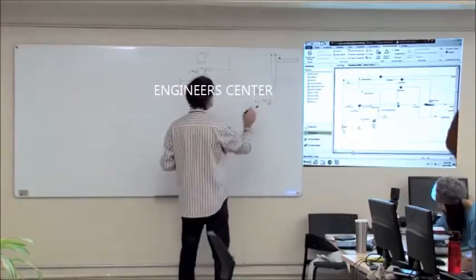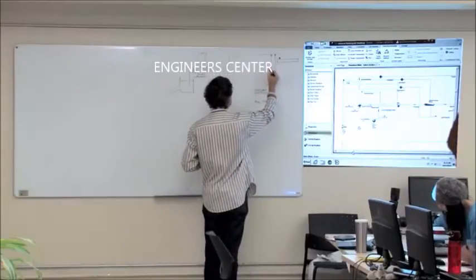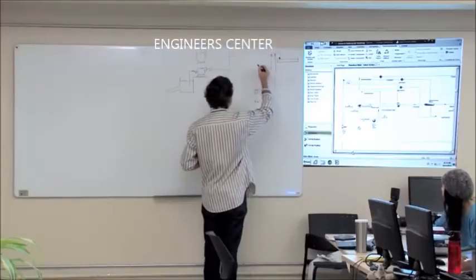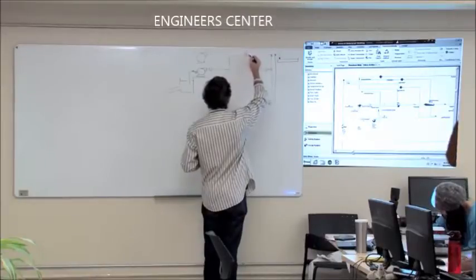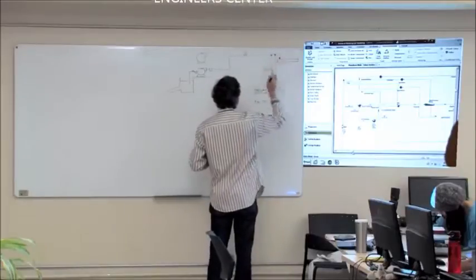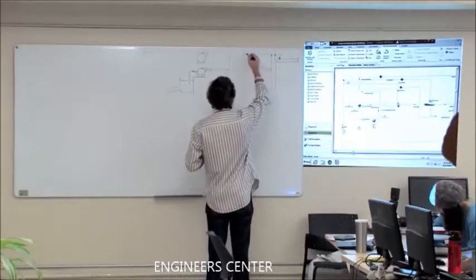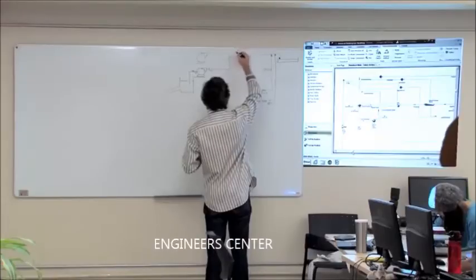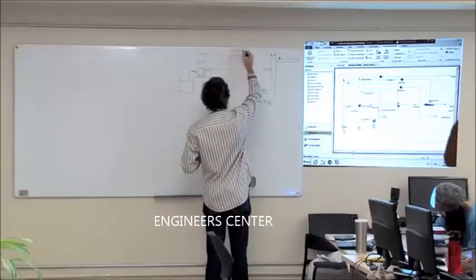Okay, so there will be some sort of flow measurement here. I think I saw this on some P&IDs. And essentially what people are doing, I think, is controlling the flow here in order to get a total flow going into the ponds. So this has probably got an FIC on it. Okay, like that, and an FE. That, DCS like that,